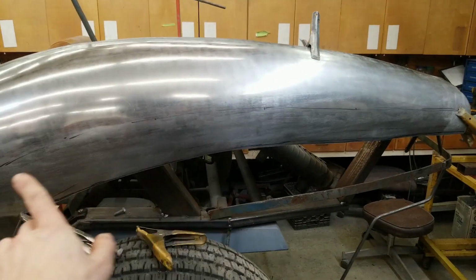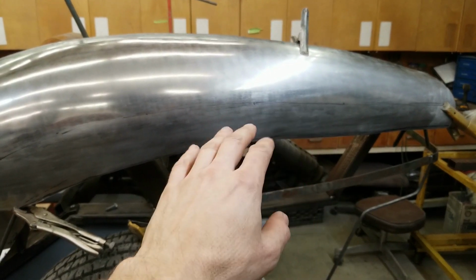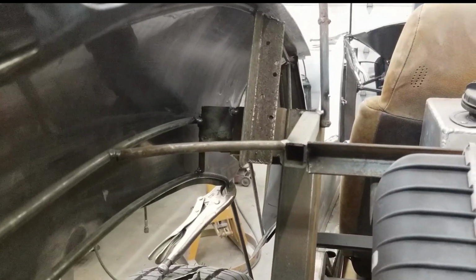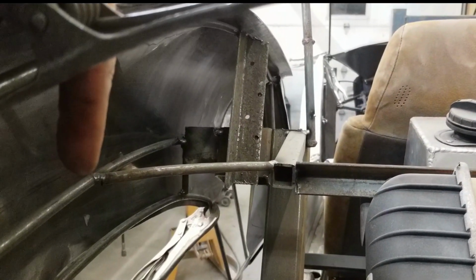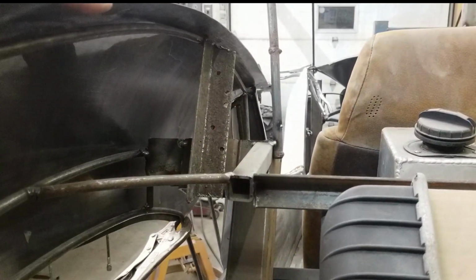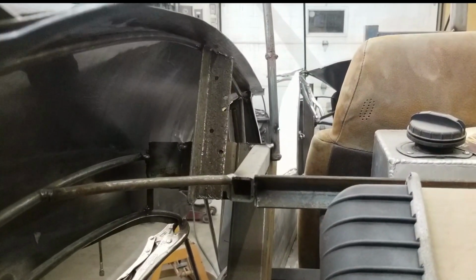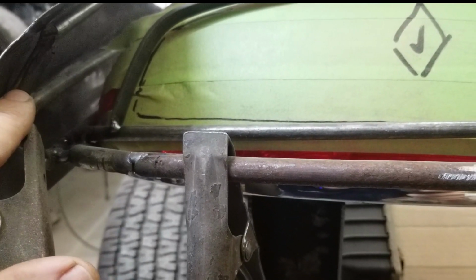And then this area will actually create a feature through there by tracing the buck from the backside to make it a definite line that comes back. So we do have a bit of a space down below here, but it's touching the rod there and touching all the way along towards the front. It's up a 1/16 of an inch or so, and we're touching back here where we need to. So that's a good thing.